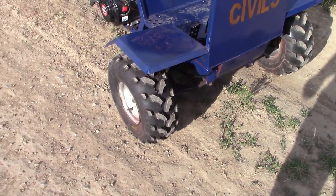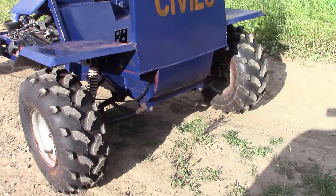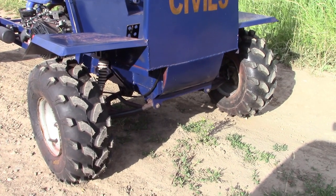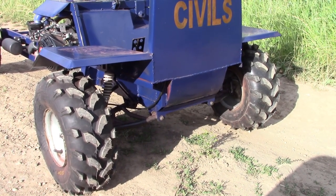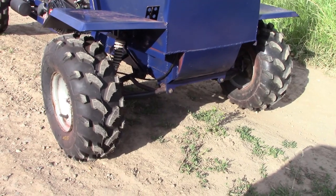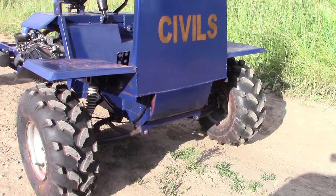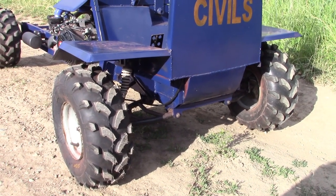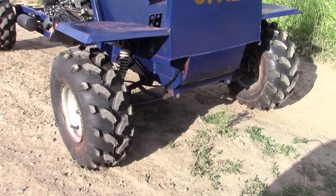The other thing is the steering. I knew there was going to be a little bit of deflection with the steering the way it is, because I've got wishbone suspension, and the point at which the steering pivots in the steering box is nowhere near the pivot for the wishbone. It's just a single wishbone, obviously, there's not two of them, so the wheel actually alters its camber as the arm radiuses. Kind of like a MacPherson strut, but without the added articulation at the kingpin, or whatever you want to call it. So where does that leave us?